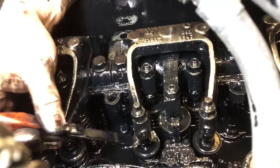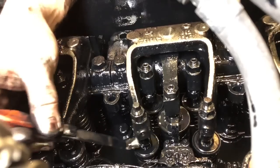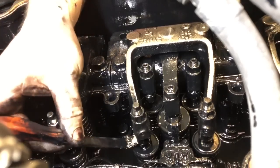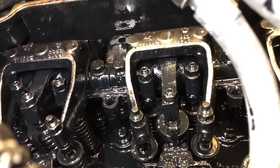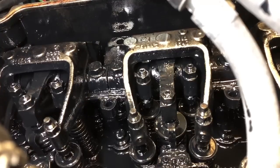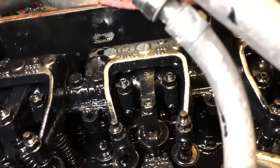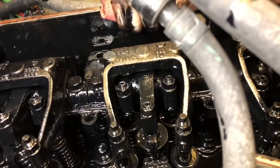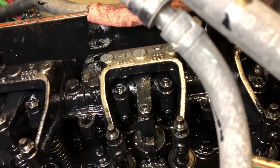But the firing order of most inline diesel engines is 1, 5, 3, 6, 2, 4. 15, too young. 36, too old. 24, just right. That is one thing that has stuck with me through all the years, the firing order of an inline six-cylinder diesel engine.